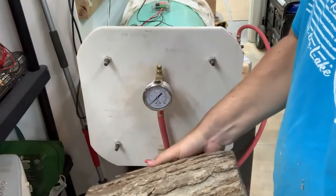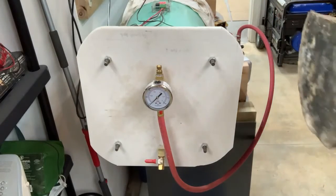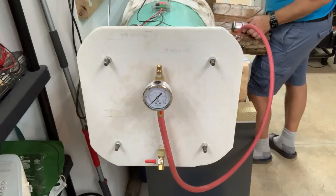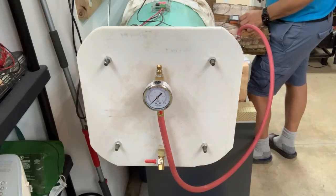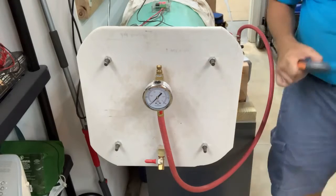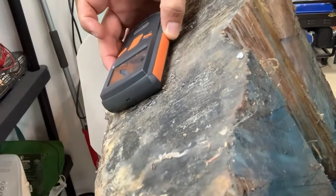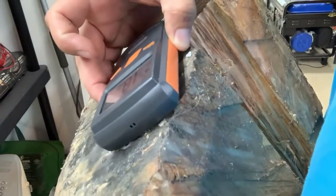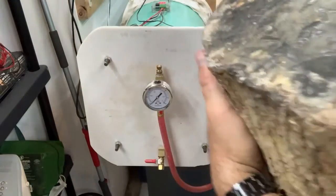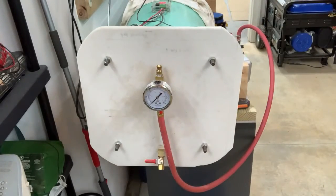I don't know — there could be a crack under the bark. I'm curious what kind of moisture we're going to register. 9, 4, 5, 12, 8. That's pretty impressive. Cause I didn't run it through the kiln. Still saying 10, 13. Maybe it hasn't dried all that much, but when you seal it off like this, what happens — from what I understand — is it can still let the water get out through the bark, but it's much slower, and that's what keeps it from cracking because you're doing it so slowly.